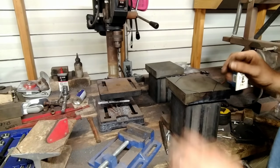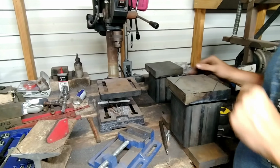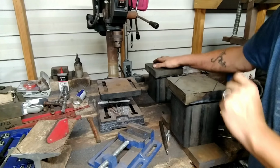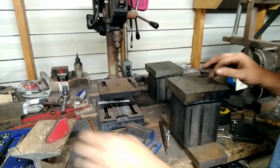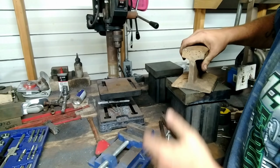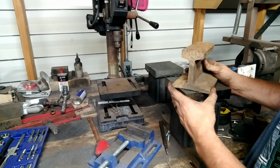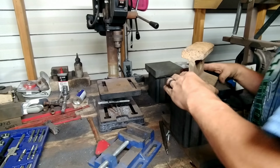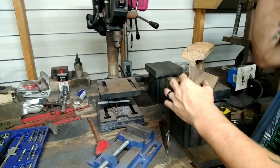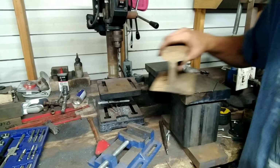All right, now it's time to show you how we're going to make our dies interchangeable. As you can see, we've got our 2 anvils made here. They're ready to go. Smaller one, a little bit taller one. They're about 1 inch difference in height. I want plenty of clearance between the dies. I got the railroad cut. Got one more to cut real quick. That's going to be a rounding die, but we're going to base our dimensions off of this, because the other dies that I can do for this thing, like fullering dies and things like that, I can make and just make a plate that fits in this system we're getting ready to build.